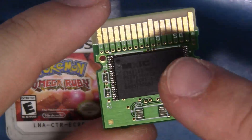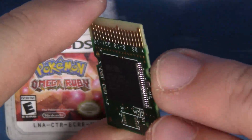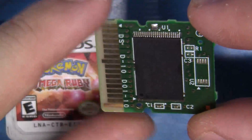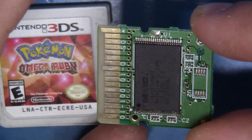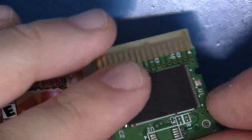I'm going to reflow this chip because my theory is that cycling this game, the surface mount package gets flexed and there's a lot of fatigue. I think we are fatiguing these solder joints. This is anecdotal, but this might be the cause. This is certainly what's plaguing Game Boy games currently. So I'm going to reflow this.